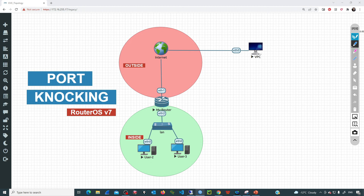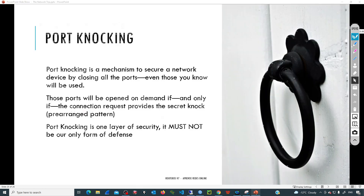If we are trying to establish a remote connection to our MikroTik device via Winbox, via SSH, or to any other service running on that device such as a VPN server, we need to open that port to the internet, and basically those ports will be visible to everyone — not only to us. Obviously we'll have a complex username and password combination, but port knocking is going to add an extra layer of security by closing even the open ports, and it's going to allow only the users that are knocking a specific sequence of ports to gain access to those services. That's the idea behind port knocking.